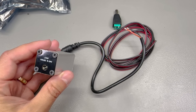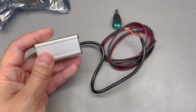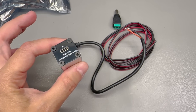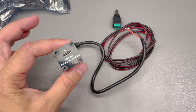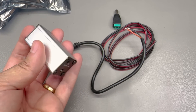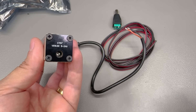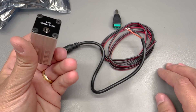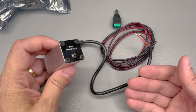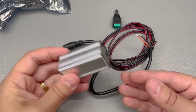Next up, during one of my many free browsing sessions on the platform, this product showed up in the recommendation list. It is advertised as a 100W car laptop charger capable of USB Type-C PD — that's 20V at 5A — boosted from an input of 5 to 28V, so it must be a buck-boost topology, able to both boost and step down depending on the input voltage. This is obviously more of a DIY kind of module — you need to do some wiring, maybe install a fuse, before being able to use this in your car. This is reflected in the cost, which is around $15 shipping included.